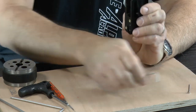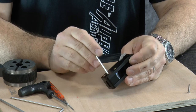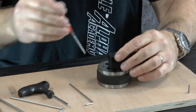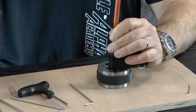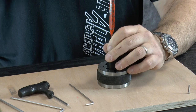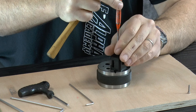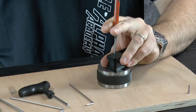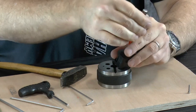Once that is out, in order to remove the slide lock you need to remove the two pins which are holding the magnetic wedge. You'll need a punch, and the easiest approach is to knock them in from the front towards the back. Keep your finger on the wedge as you knock out the second pin, because the magnets are rejecting each other and they will push that wedge clear out of the block.